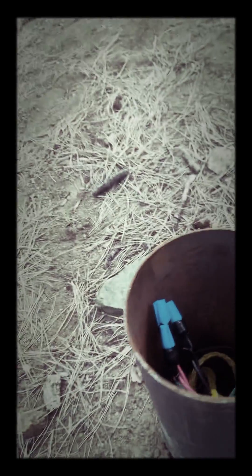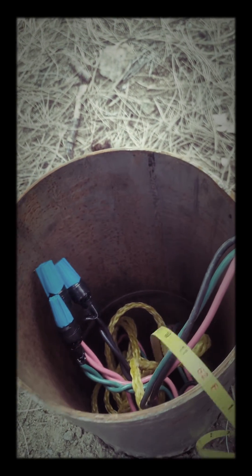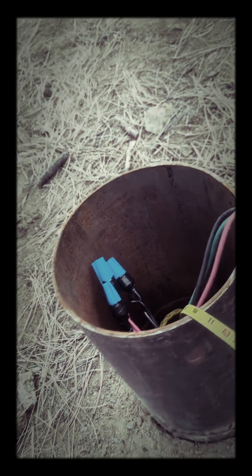I have a very nice, easy, low-tech way of checking it out, which is basically going with this tape. I don't know if you can hear the splashing, but basically it starts to splash at about 62 feet. And if you're not sure about whether you're actually hearing the splash, I brought the tape up and there was water around the end of it.